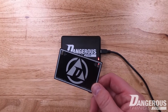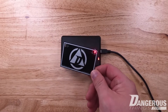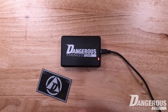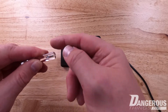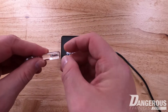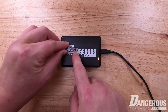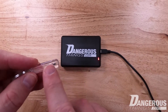That's a quick overview of the RFID diagnostic card. The important thing to know is that while it can show you the frequency and duty cycle of a reader, what it cannot do is show you the best orientation or location on that reader to present a chip implant. For that, you'll need something like the X field detector keychain. Inside the keychain is a device that mimics the coil geometry found inside X series implantable chips, and because it mimics the actual coil, you can determine which specific areas of the reader will give good coupling with your implantable chip. Check the links below for a video specifically about this device.